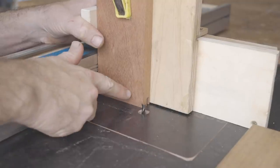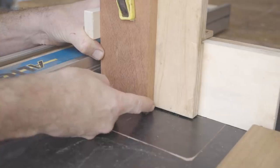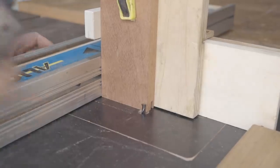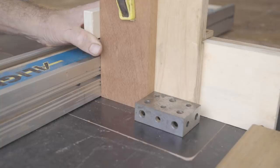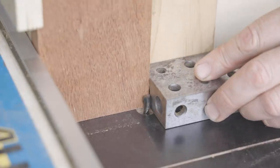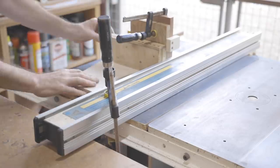The last part of the setup is to find the starting position and line up the outside of the bit to the outside of the workpiece, just by adjusting the fence. I'm using a 1-2-3 block, but anything square — a piece of plywood, whatever. I'll clamp the other end of the fence down as well just to make sure it doesn't deflect at all.